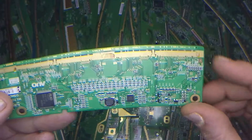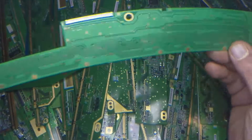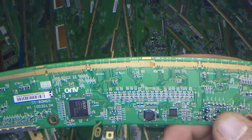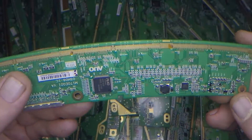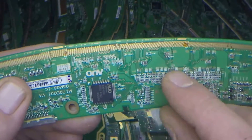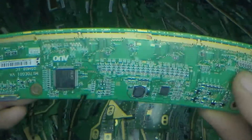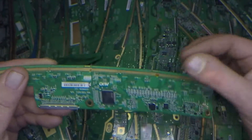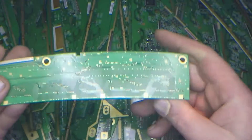What I'm starting to see is people cutting the gold fingers off these boards. But they're one sided, so there's no real point in removing just these gold fingers, because you're going to want to process this whole board. If you remove all these little chips and all the little resistors and MLCCs, clean this board up and just have it green with the gold plating or flashing, then just process this whole board as you would just fingers. Cut the board up in pieces and process each piece.